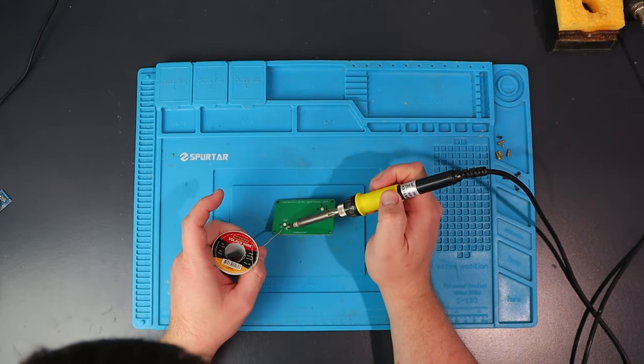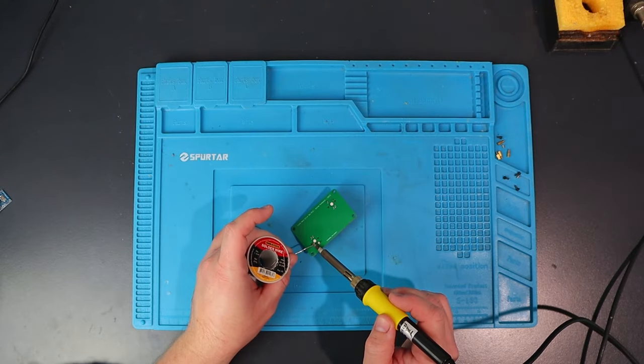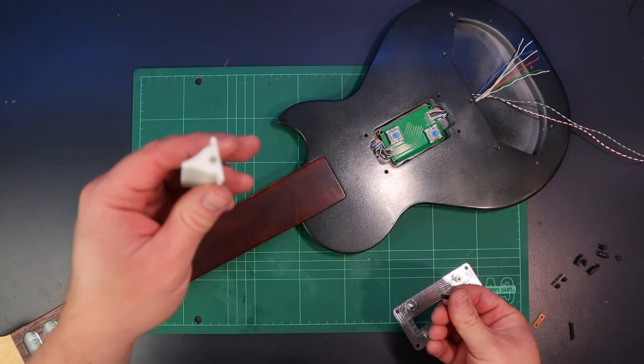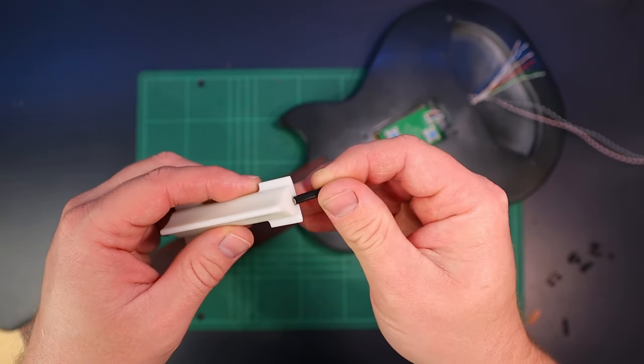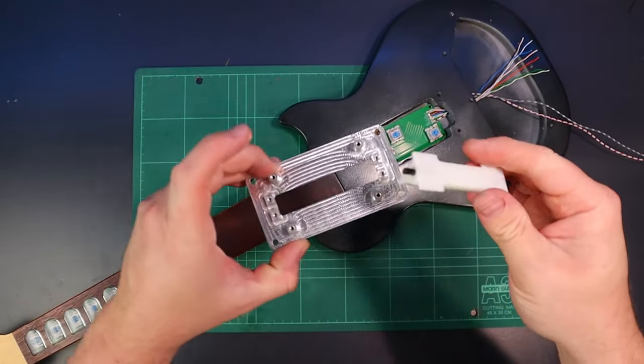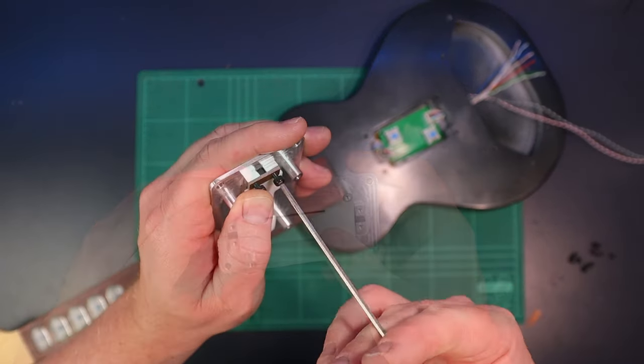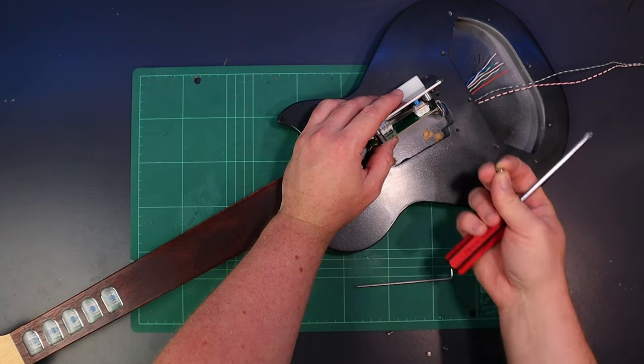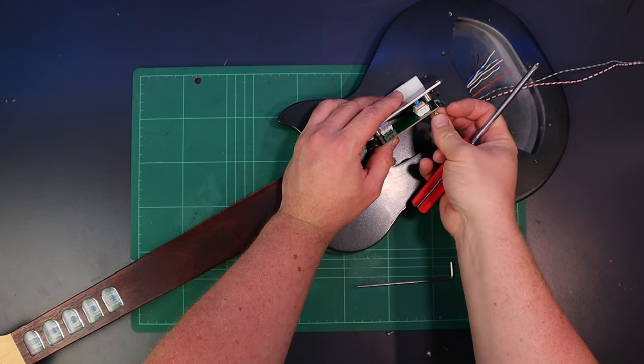I've given the strum bar mount the same polish and clear coat treatment that the neck retainer plate got, so let's assemble the strum bar module now. I'll insert a bit of 4mm carbon rod into either end of the strum bar and fit it back into the strum bar mount. I've used a couple of spare bits of PCB material to make the retainer for each end of the bar. There's about 0.1 of clearance between the strum bar pivots and the retainers, so they're free